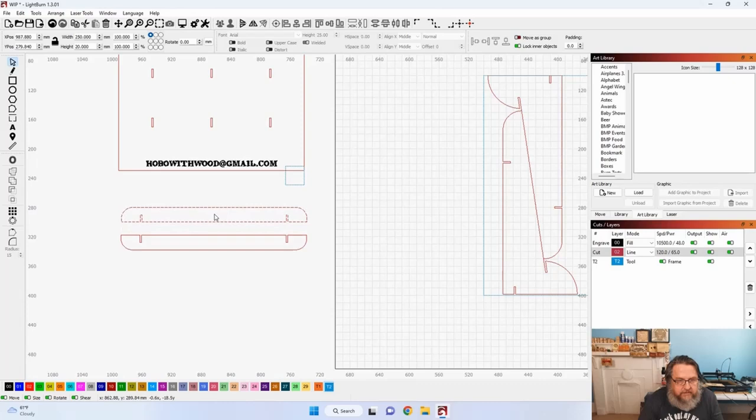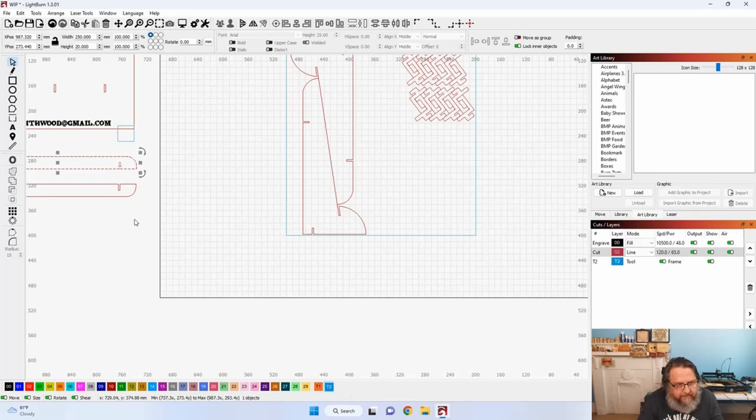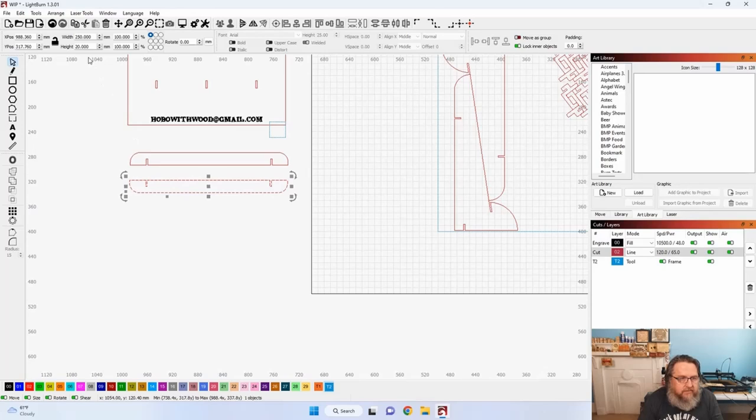All right. So there's a brace to snap in there. Oh, no, I didn't think about the overall height of that. That is a problem, or could be a problem. If that's only going to come down 10 millimeters and I need it to be sitting flat, then this overall height can't be more than 20 millimeters. Oh, and it is. The height is 20. Did I get lucky there? That's 20 millimeters. I got lucky. I wasn't even thinking about that, but this is going to insert in here and it's only going to come down 10 millimeters. Once it comes down to 10 millimeters and stops, then the distance from the bottom of that slot to here can't be more than 10 millimeters or else it wouldn't be sitting flush. But I got lucky without even thinking about that.